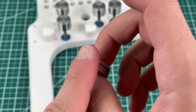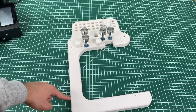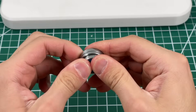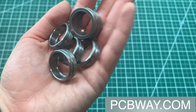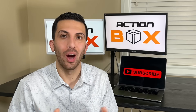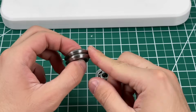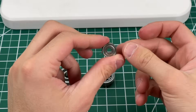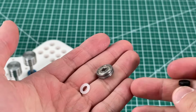With the driver rollers now in place, let's move on to the guide bearings. These are just groove bearings which help transfer our wire around the frame passively. They spin only when the wire is pulled by our driver rollers and their grooves guide our wire precisely where we want it to be. I have three different options for these guide bearings. The first is a ring machined on a lathe with a perfect fit to any standard 22 millimeter bearing — PCBWay.com sponsored this part by waiving the $300 price for 10 of these parts, which I simply uploaded as a CAD design on their website. At that price per piece I had to find an alternative, so I found groove bearings at $10 per piece, but they were very hard to rotate. In a classic too hot, too cold, just right scenario, I found tiny groove bearings for just $2 per piece which rolled very easily with our brass wire. Now that we know which idler bearing we're going to use, let's install them onto the threads, using a washer to properly space the bearing from the frame.